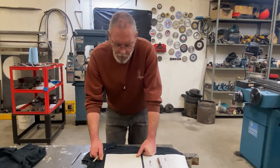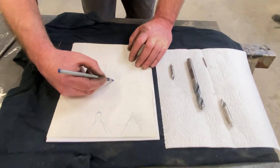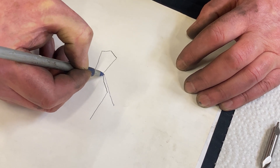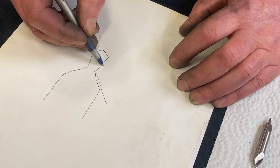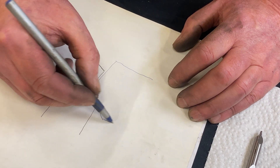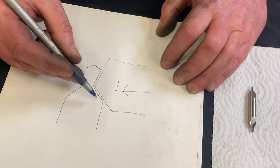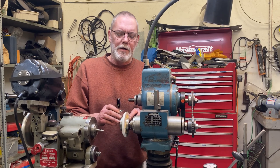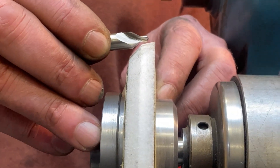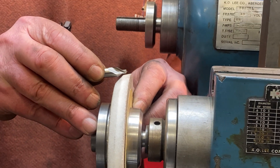There are probably several different ways to accomplish this, but I've chosen what I think is the simplest. What I'm going to do — pretending this is my grinding wheel — is very carefully dress my grinding wheel to exactly 60 degrees and then this small little angle here, which I haven't calculated but will be very very slight. That will allow us to plunge in with our grinding wheel in this direction and, if need be, travel slightly in the other direction and clean all these surfaces up at one time. I've picked out a grinding wheel with a profile that's somewhat close to where we want to end up, which will let me take the least amount of material off, and material costs money, so this is the best wheel I have to start with.